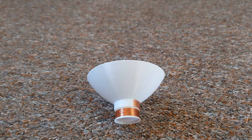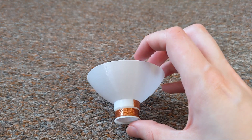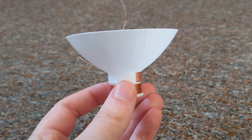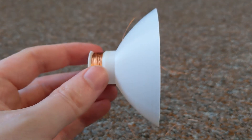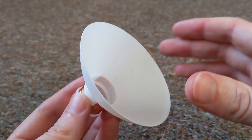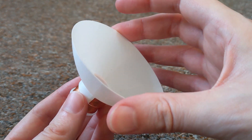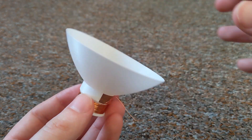Concave cone. This cone is built solely to look at the break up point of the material and how it reacts after this. The stiffer the material, the higher the frequency will be. After this point, the distance between the peaks and troughs will help us understand how much damping the material has to control the frequency response.